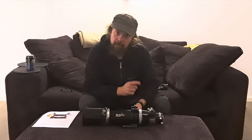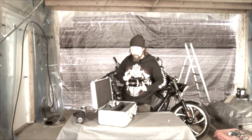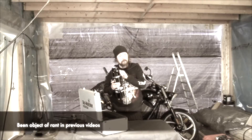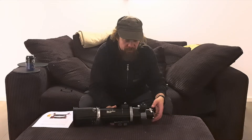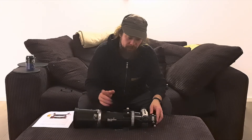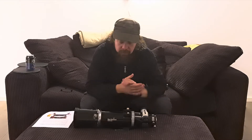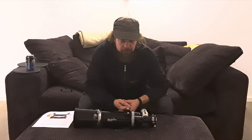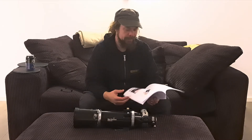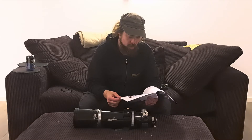Now let's get right down to business — the Crayford focuser. It's fooled me twice now. The little set screw that holds the focuser in has caused issues where it just couldn't hold focus — the weight of the camera pulled the focus tube straight out. Not knowing better, I replaced it with a machine screw by brute force. The better approach is to find a proper instruction — I found one, credited to Tommy from telescope-austria.com.